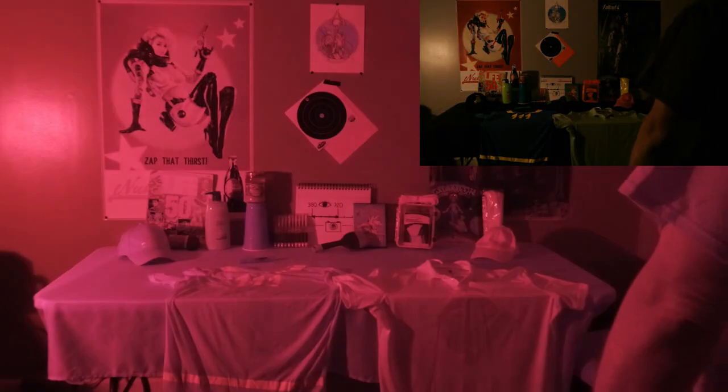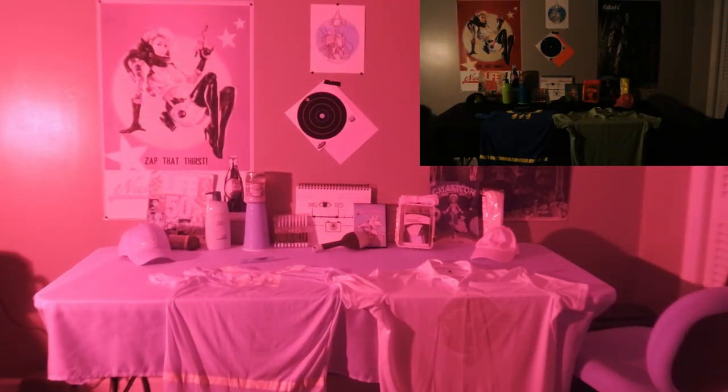And let me switch over to the old timey, real wound filament bulb, much more orange light. And you can see the difference between the two in how the cameras respond. Now notice that the 1J5, the full spectrum camera, is having no difficulty getting a lot of light for the picture. And that's largely because of the infrared content of an incandescent bulb.